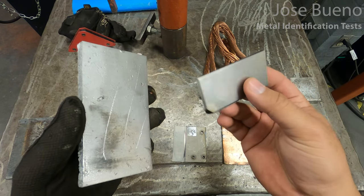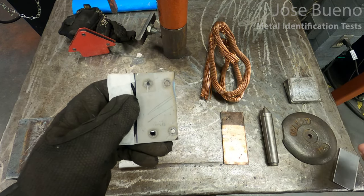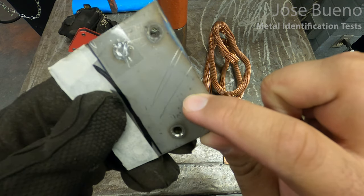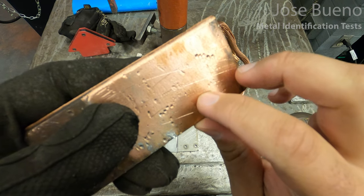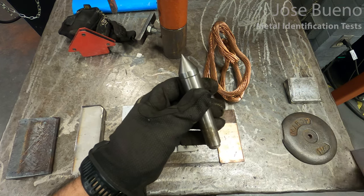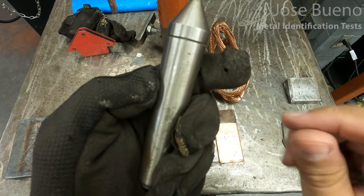This will really help you out in the event you have some material and you're not sure whether or not you want to spark test it — go ahead and scratch it with something you know to be steel or low carbon steel. Now as I test the specimen of titanium, the control is leaving marks on the surface of the metal, but it's not actually scratching. So this tells us that titanium is in fact harder than low carbon steel. Now let's go ahead and scratch test the copper. I'm getting some good deep scratches in the surface of copper. Copper is a known soft metal, which is softer than steel. With the presence of more carbon we increase hardness — and as I try to scratch the tool steel, putting in a great deal of effort, I've got nothing. So this is harder than low carbon steel.